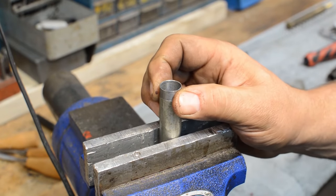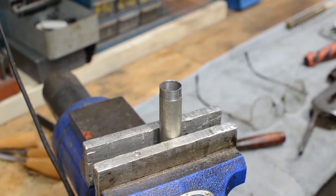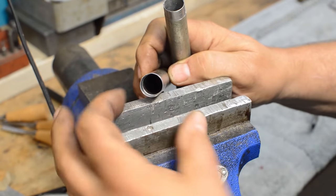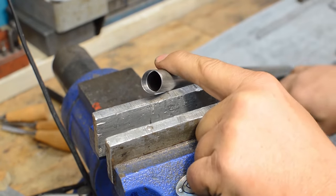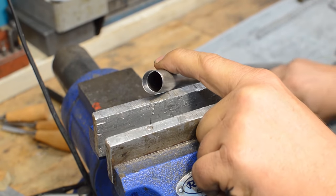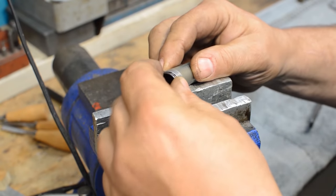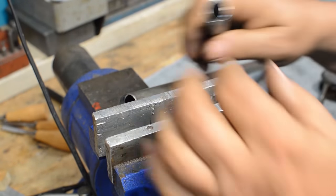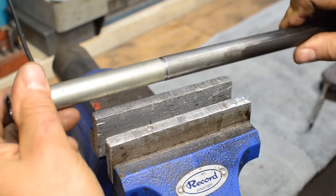When we're all done, we'll put a stick down the center of this thing with a little bit of 400 grit sandpaper on it. We'll just spin it and polish the entire inside of the tube right around the joint. There was just enough material to cut the inside off of this and enough to cut the outside off of it. And most importantly, have this follower disappear down the inside, come right out. That'll get polished, right? So these two will just plug together.